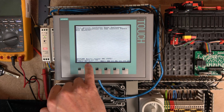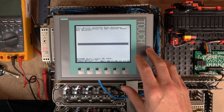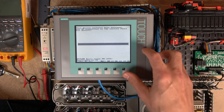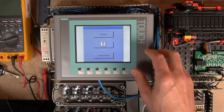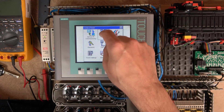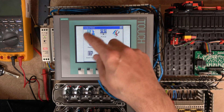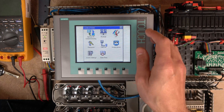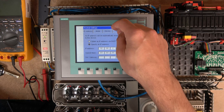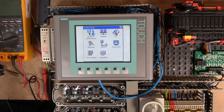I've already updated my OS - this is the latest OS available for this particular screen, which I'll show how to do in a minute. If you want to change the IP address, once it loads up, go into the Control Panel, then go to PROFINET. In there you can select your IP address and click Save. There are also other settings like screen savers and service and commissioning options. For the IP address, just go in there, change it, and click OK to update it.